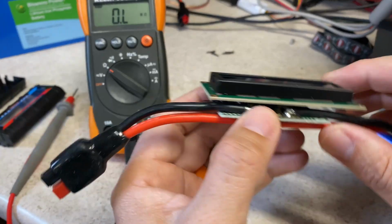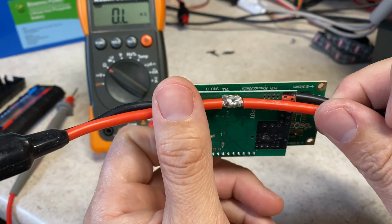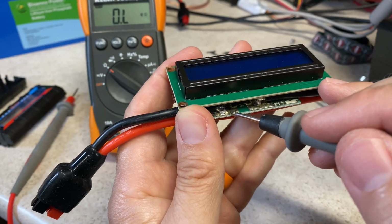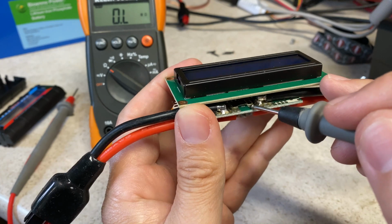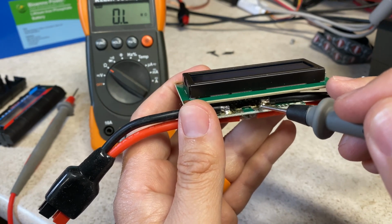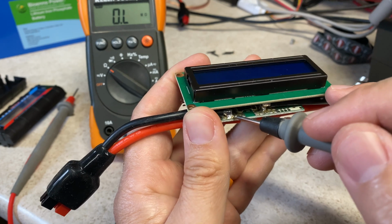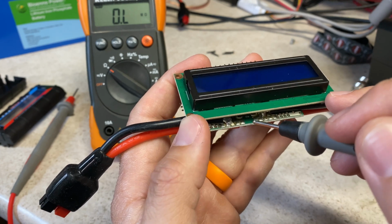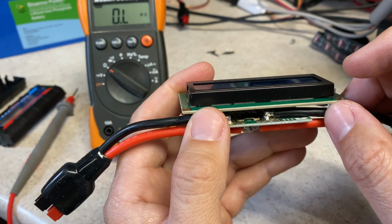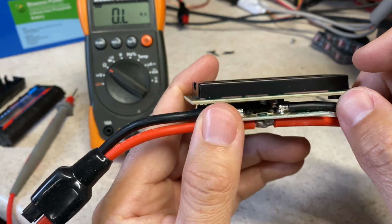I'm no engine nerd. I'm no electrical engineer, but I don't see enough current carrying capacity on this PCB for 150 amps. I've seen circuits that are rated for far less at 12 volts have way thicker and heavier traces. So yeah, this seems suspect.